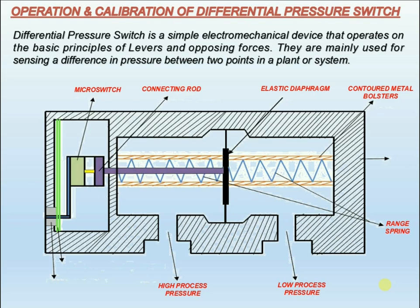Calibration and adjusting a pressure switch: The adjustment of the switch point or set point is made by set point screws accessible from the front of the differential pressure switch case. The graduated scales enable a relatively accurate adjustment of the switch points and indicate the set point that is momentarily adjusted.